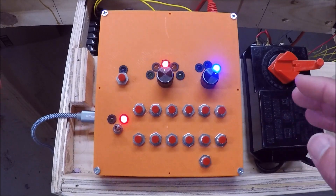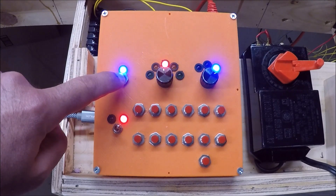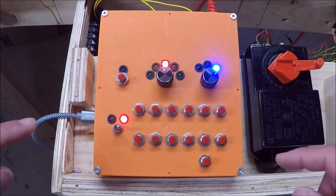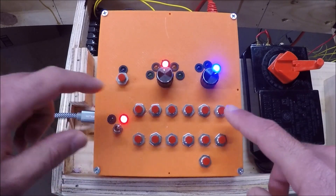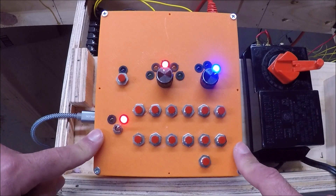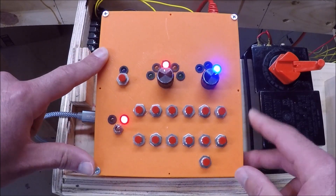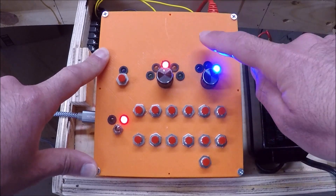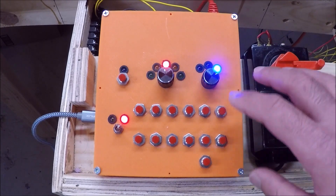Another great feature: if you hold down the program button for longer, it does a series of flashing, then saves all programmed positions permanently to the controller. So you can unplug it, do whatever you want, plug it back in, and all positions are still saved. The controller also has a built-in auto-reverser — it determines when the turntable has moved more than 180 degrees and automatically flips polarity. You don't need to do it manually or configure a third-party device; it's all built-in.